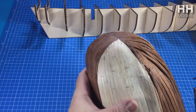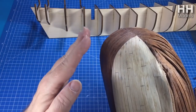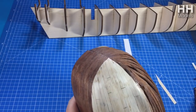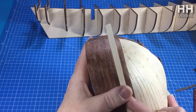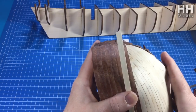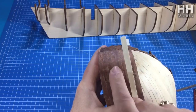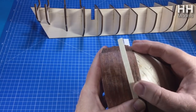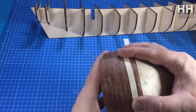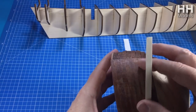If you try and taper the bottom and keep the top straight, the way the wood will bend is it'll buckle out and there's no way you can get it flat. But as you can see with mine, with the tapering on the top, it is perfectly smooth — you could play billiards on that. The top part of the plank has the taper. If you imagine the way it's going to curve, it wants to curve up at the bow, so if you take a little bit off the top and let the plank basically follow its natural line, it will take that top part up further. If you're always tapering off the top of the planks, they pretty well lie exactly as they should — and that solves so many problems.